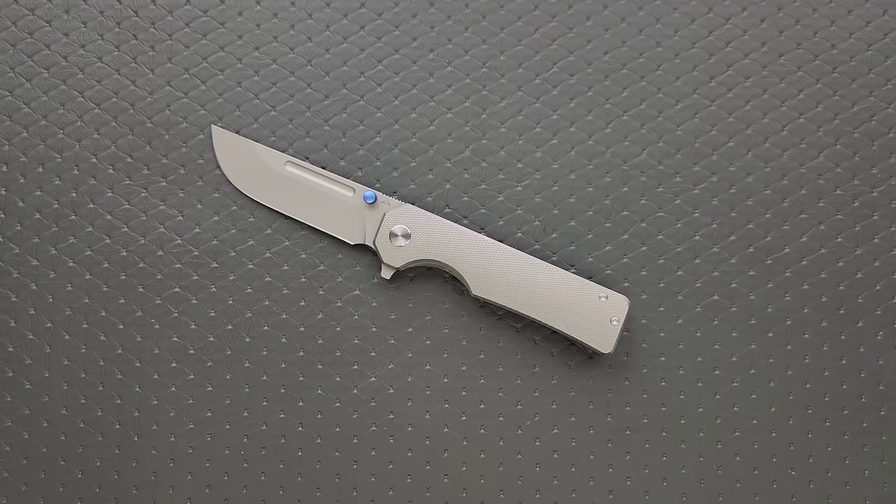So if you are looking for toughness and ease of sharpenability, the answer is not to make S90V softer — the answer is buy a different steel. The composition and what it is meant to be good at, you can't just decide you want it to work differently because you have different needs; you get a different steel. S90V performs optimally when considering its primary application, and you can get that out of it in a folding knife. If you need toughness and ease of sharpening and you don't care about corrosion resistance or edge retention, you buy 1095 — that's what you want.